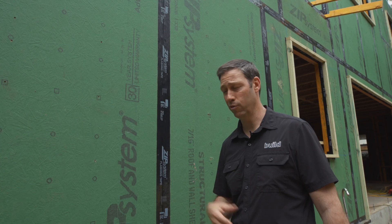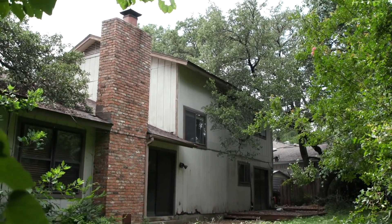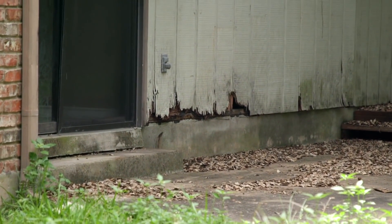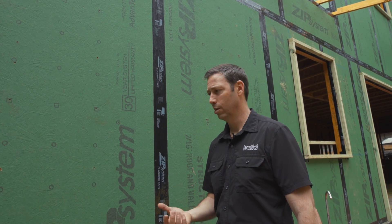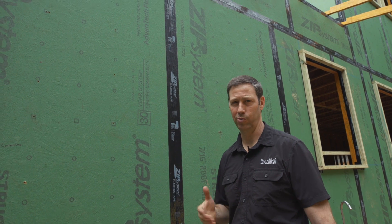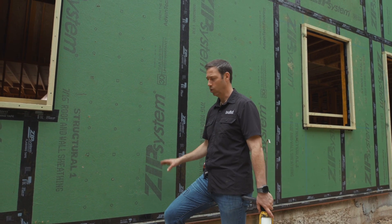On the other hand, as I've remodeled for 25 years, where do I find all the issues? Just like at my personal house here, this back wall had massive issues because it had no gutters — the water was spilling over and splashing back onto the old T1-11 siding. The bottom foot was a mess, a disaster. But up here, four or five feet up, no issues whatsoever. This leads me to believe that if we tape those seams and have a couple of overdriven nails, there's not an issue — but we should be concerned with that bottom one to two feet. That's where all the rot and mold happens.